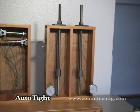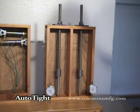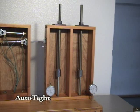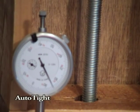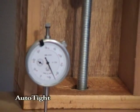The first demonstration showcases the action of a properly connected shear wall. Load is introduced into the top of the shear wall. As the shear wall walks back and forth, the compression post and rod alternately carry the tension and compression loads into the foundation. Dial indicators mounted on the base show system backlash — between two and four thousandths of an inch of movement or wall flexing.